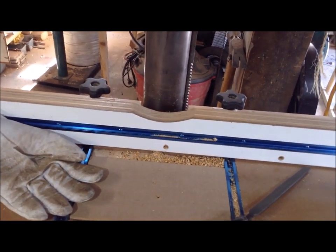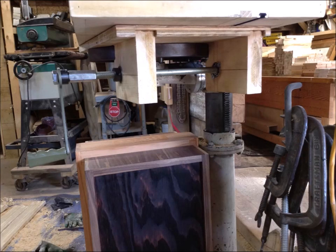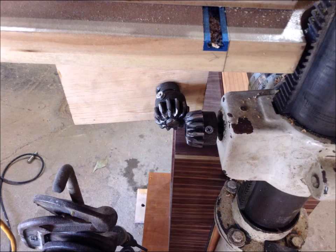So this is now done, and I'm pretty happy with this build. It was a huge upgrade to go from using a vice grip to raise and lower the table to a handled mechanism — I'm still getting used to the convenience of it. There's not a lot of play in the gears, which I was a little worried about. I was nervous about it getting out of sequence over time, but I've been using it for a bit and it seems to be holding up fine. I was also happy that I got to use materials I had laying around my shop — I only had to buy some nuts and stop collars for this build.